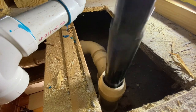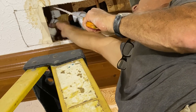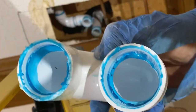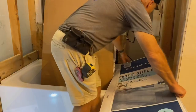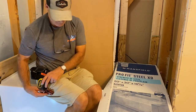It's a good idea to get the water out of the old trap before you cut it out — that water stinks pretty bad and you definitely do not want to spill it in the ceiling. Getting this thing re-trapped was irritating. I did not cut enough sheetrock out of my way to push the trap on, so I had to pull it back down, clean the old material out of the joints, move the sheetrock out of the way, and try again. But eventually we made it happen. Before we hang this valve, we're going to cut a little protection out of cardboard so we don't scratch or chip the tub if we drop something.